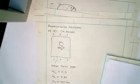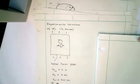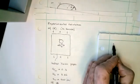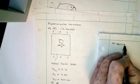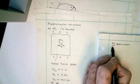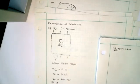When you validate something, you're going to have experimental scatter, so you have to repeat your experiments. He did 30 specimens. How did you pick 30? Well, he started off, I think, with 6 or 7, something like that. And he got a mean value. Then he doubled the size and he got another mean. Then he doubled again and got to 30. At this point, the mean values were not changing. And so then you know you've got enough specimens when you're doing tests.